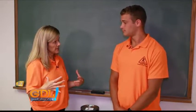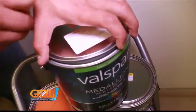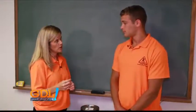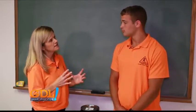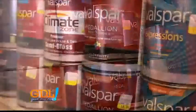You have all the tools people need here, and also some of the best paint in the industry with Valspar. We carry Valspar Medallion, which is 100% acrylic, so it bonds better to an already-painted surface or a primed surface. It covers really well and blocks out darker colors even better. When it comes to priming, Valspar Medallion has a primer in it which works in most cases. You'd want to prime first for new drywall, bare wood, anything slick — you'd use a bonding primer. For stains, use a stain-blocker primer to make sure it covers well and you don't see it through the paint.